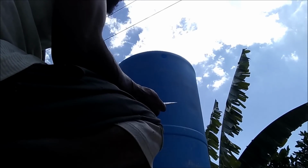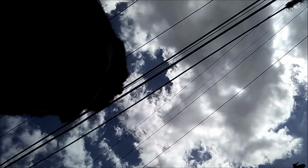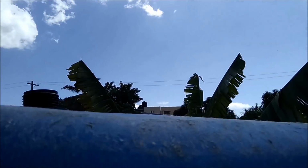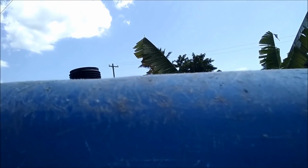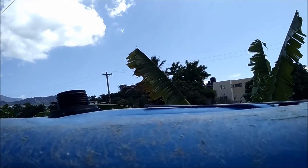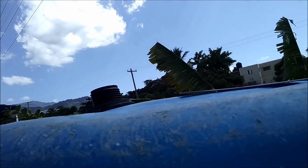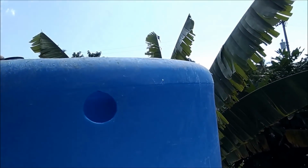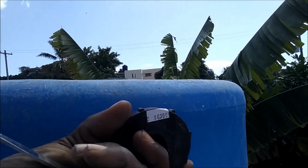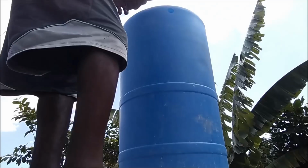But as you can see, the hole is pretty round. I do it in two parts. First, I cut this front part at an angle, bring it around, and then I go back in again, kind of deeper, and take it out. Alright, it doesn't fit tonight, so I work it until I get this bulkhead fixed inside it. Alright?